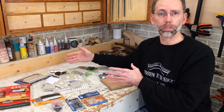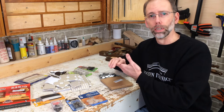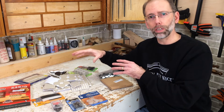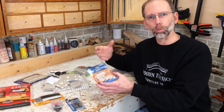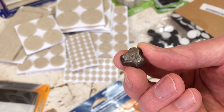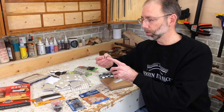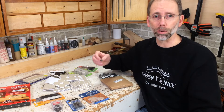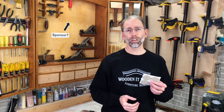That's where felt really comes in. Felt is great because it's just an adhesive, and if it does wear down, it wears down to bare wood. You do run the potential of scratching the floor at that point, so you need to pay attention. The key challenge people have with felt pads is they put replacements on and they're not sticking — they get frustrated and look for a hybrid screw-on product. But I think the risk of damaging your floor is too high. I've also got an antique glide here that has scratches in it — it was on a piano bench. Great for protecting the end of the wood furniture, but definitely not for a hardwood floor. The key is to make sure you're solving the right problem — choose the product that works on the flooring you're protecting, and if you're using felt pads, make sure you buy a quality product, not an inexpensive one that will fall off.